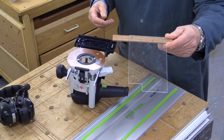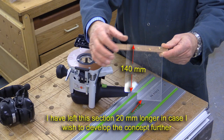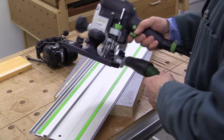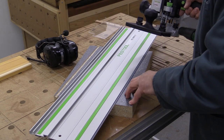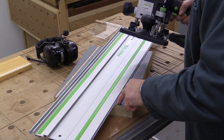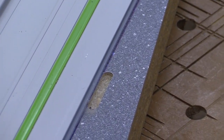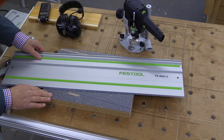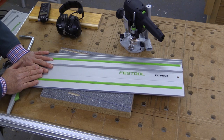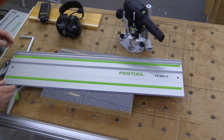Using this system I can now use the undamaged splinter guard edge of the guide rail to position the rail itself in exactly the right place so I put my cut where I want it. Just a simple piece of perspex and a little piece of wood screwed on — very simple. I've set the router up using my template so that is exactly 140, drawn a line on my piece of worktop, and I'm able now to judge where I expect the cut to be. I had the guide rail fixed because I didn't want the router weight to make it rise up slightly.